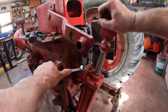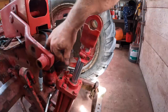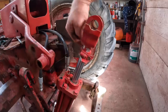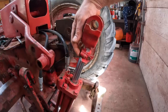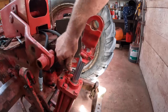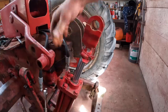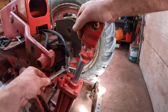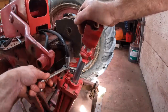We can disconnect the hydraulic lines to the cylinder. This cylinder has a depth control setting — this button here relieves pressure when it's coming down. This is meant to be a collar that goes all the way around and it's broken. I think I broke it when I was plowing one time. Anyway, you set this stop wherever you want it, and when it comes down and contacts this pin, it relieves through here and the cylinder won't go any lower. So you can set it to your plowing depth and it'll automatically hit it when you put the lever down to start the next pass.